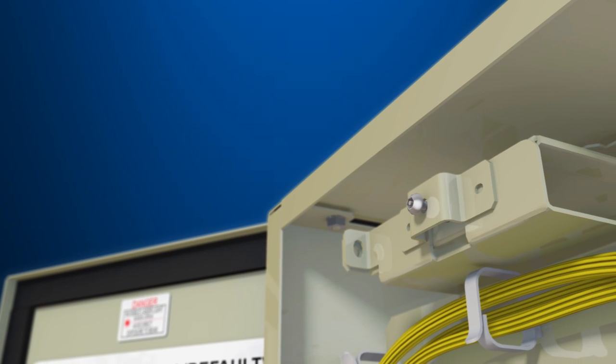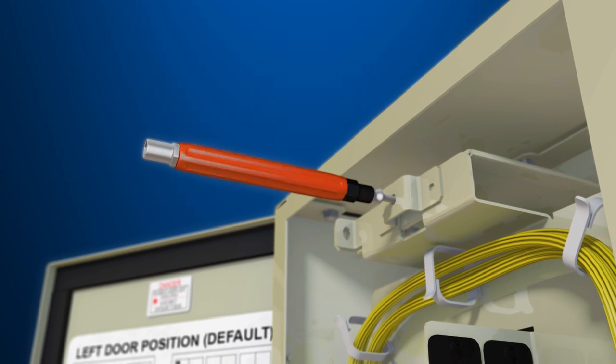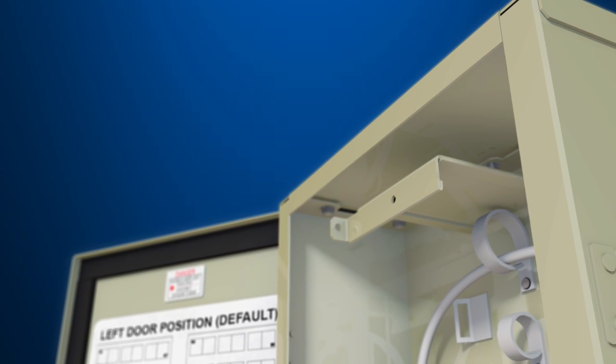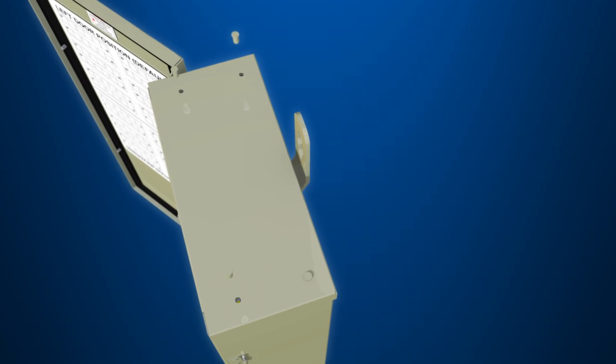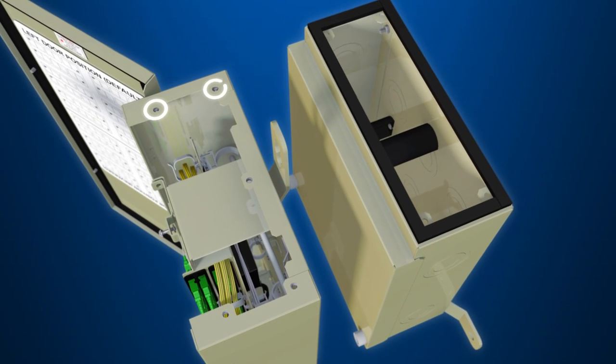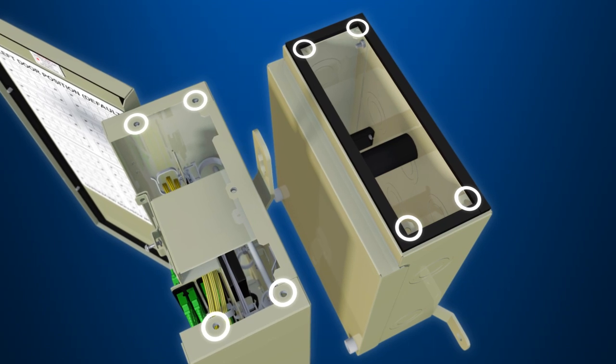For efficiency, a 216 tool removes all but one screw on the LL580, and a single pin and hex screws secure the splice chamber. Whether mounting the LL580's bottom or top plate, the skirt top or skirt bottom, all of the connection points share the same bolt pattern, thus simplifying installations.